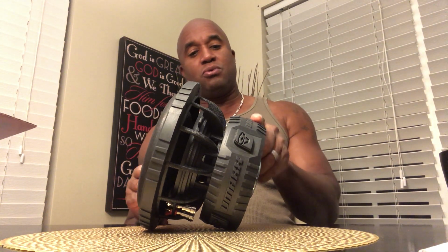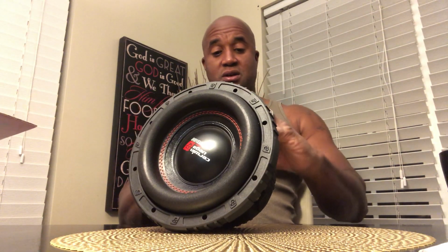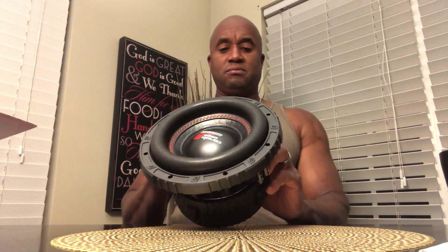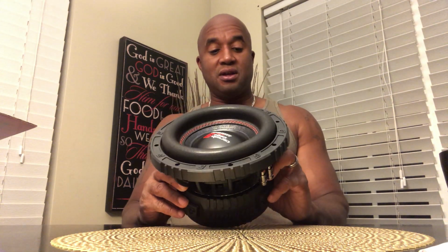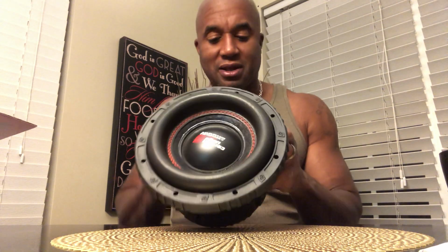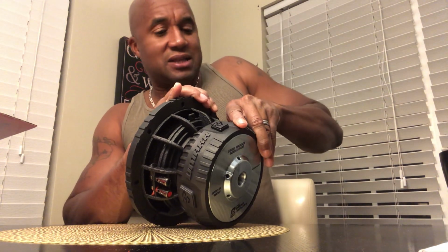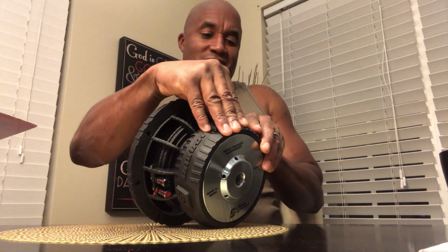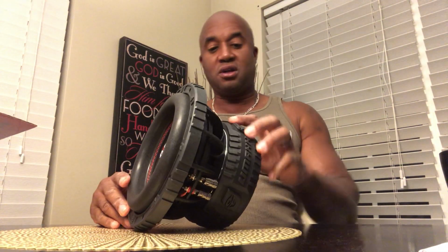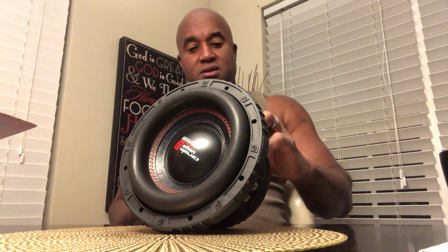So we got a nice little motor build. It's made for this, too. Well, that's stiff. It looks like maybe an inch, 8.75. It's got a very high top plate. I can't even get my finger in here, man. Can't even get my finger in it. Okay, that top plate, using my caliper, is 3/8 of an inch thick. So the slugs might be just half an inch to 0.65 each. Might be just a single.